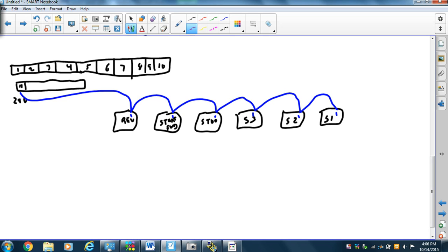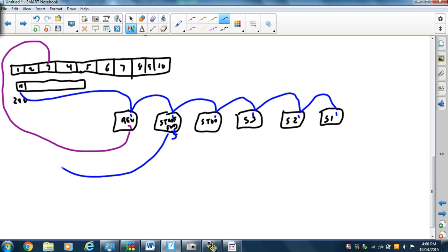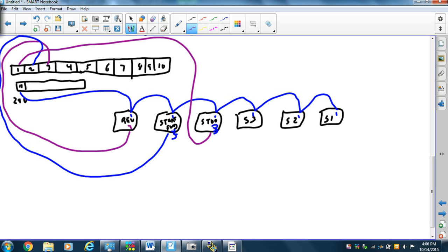And we're going to go from pin 2 of the reverse guy, and we're going to come over to pin 3, which is reverse. We're using pin 3 all the way across. Pin 3, which is start forward, we're going to hook up to pin 2, and we're going to come from pin 3 of the stop relay, and if I would have done this better, I wouldn't have had to cross my lines, to pin 3. Well, that is really a silly looking picture, isn't it?